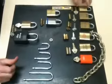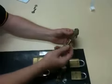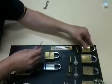About 30 years ago we started with the Lockwood 234 padlock, which was an inline, top-loaded, snap-shut padlock. It had a unique barrel — the barrel was inserted, with pins and springs loaded from the top, and plugs bashed into the top and linished off to finish. Snap-shut means you can take the key out and snap shut the padlock without the key being in there.